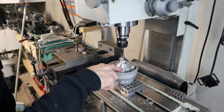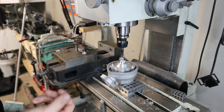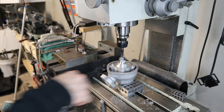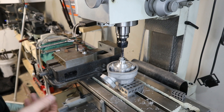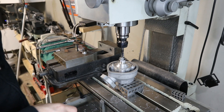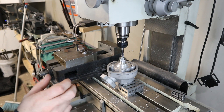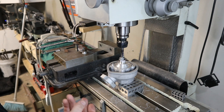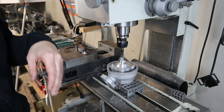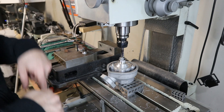Repeating over on the second hole — the holes measure about 6.2 to 6.3mm right now, so it really doesn't take much material out. Just thin, wispy chips, but it's enough so that a 7mm dowel goes in there. It doesn't need to be a perfectly snug fit like a precision dowel. A reamer would be better, but with the cast hole I think a reamer might walk as it tries to follow the existing bore. The end mill is better here because it's end-cutting, so it goes straight down.